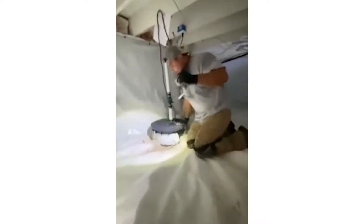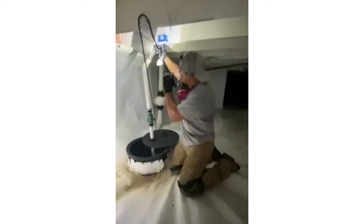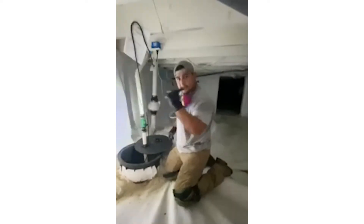Here's a sump basin. I'm going to open this up and make sure the sump pump actually works. I lift this and it doesn't work. So I check if the GFI is popped — and it is. Now we go back in and it kicks on. There it goes.